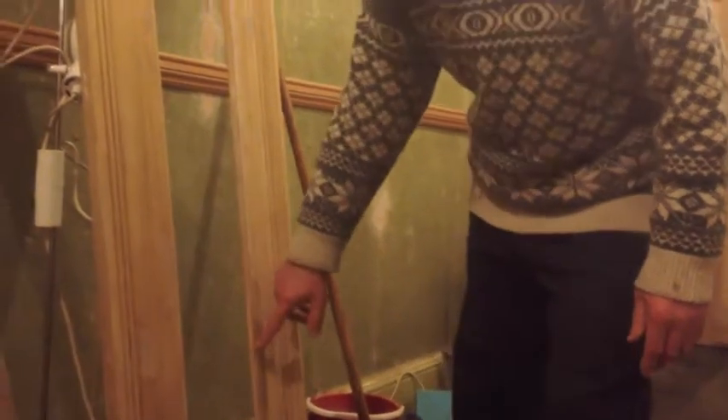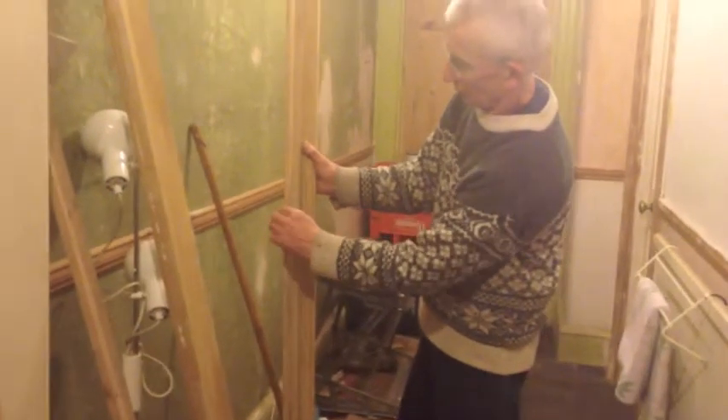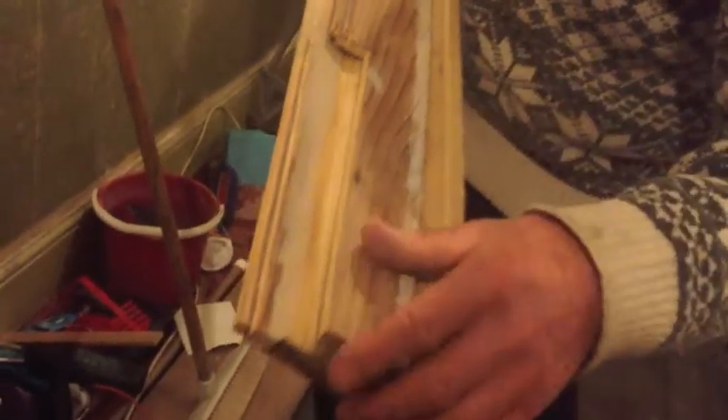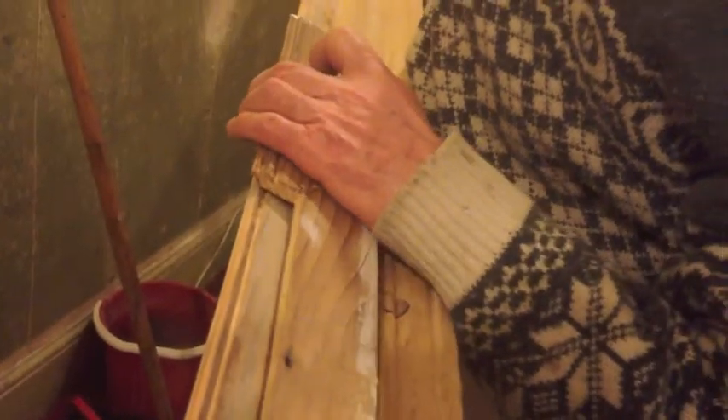I've got a slightly bigger, slightly bulkier round bit than the original architrave, so what I've then put is a piece there to there to join, to taper it so that it doesn't notice too much, so there's no step. At the bottom, that was just a tacked-on piece of round, sort of hand-rounded, which was tacked on and came down to a much narrower piece there. So I've now spliced in another piece here and made that out of this. The bottom of that came from there, but that's a slightly different dimension, so I've actually cut that back and I'm going to fill it with filler to bring that to that position, with a square edge instead of a beveled edge.